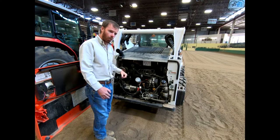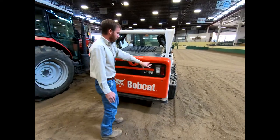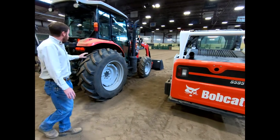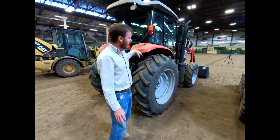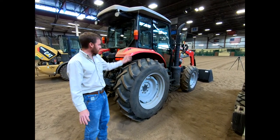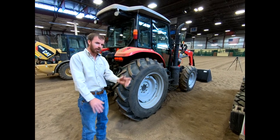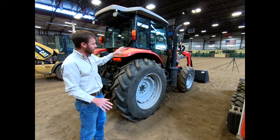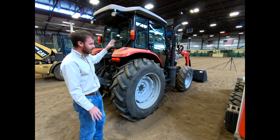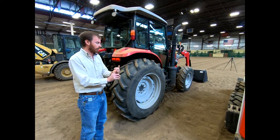We'll close this up and walk over to the tractor. You can see on the back we've got brake lights, reverse — everything else. This one will beep as we back up. This is a Massey Ferguson tractor — a 103 horsepower tractor, a true farm tractor. We talked about those subcompacts, compacts, and utility tractors up to the farm tractor. Do realize when we talk about that 100 horsepower, we've got fewer horsepower at the PTO because some of that is being used for the alternator, AC, and other components.